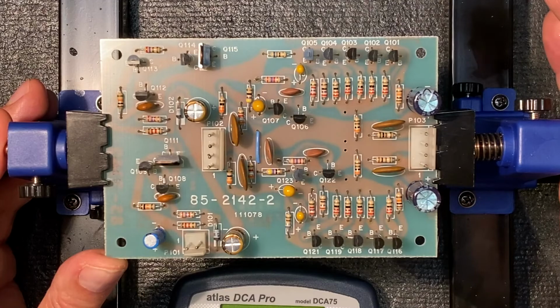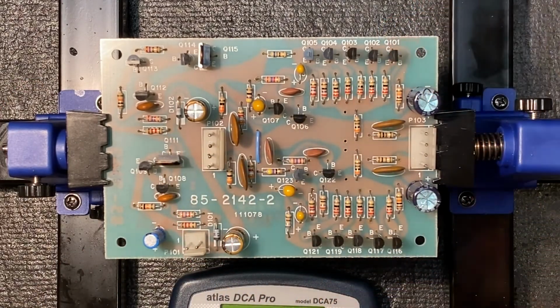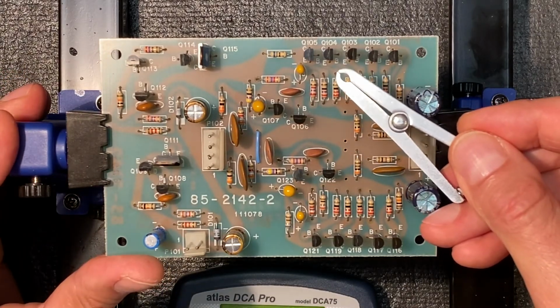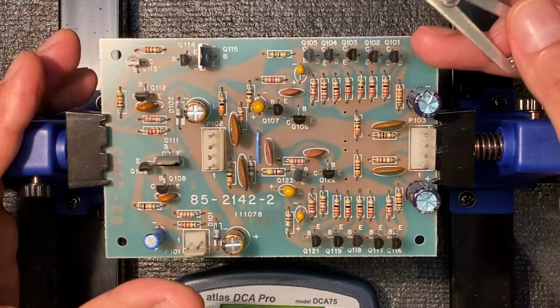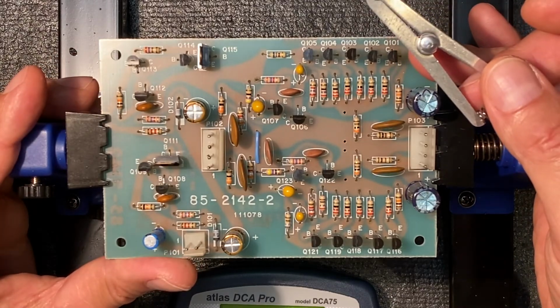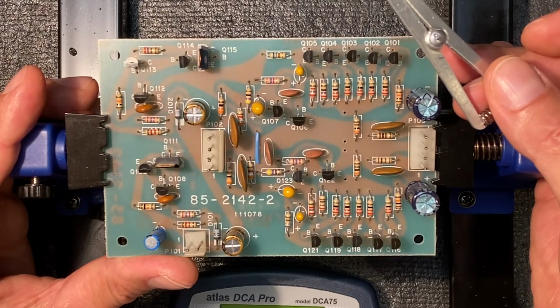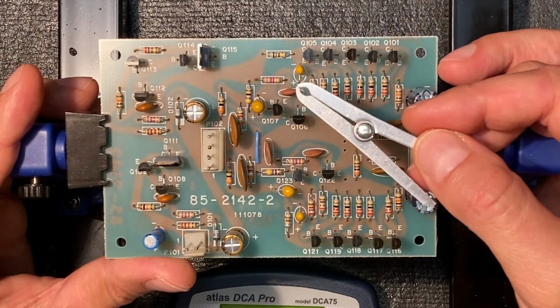You may also notice that when I install the diodes and transistors, I'm using a heat sink before soldering them. Diodes can be damaged by the heat of the soldering iron when they're installed, and let's remember that transistors are nothing more than diodes packaged into one unit. The diodes and transistors on this board are of the type that should be able to be installed without using the heatsink, if good technique is used when soldering. Nonetheless, I still use the heatsink just for peace of mind.